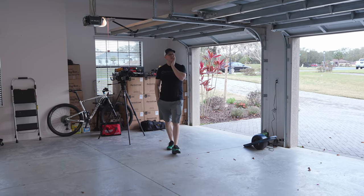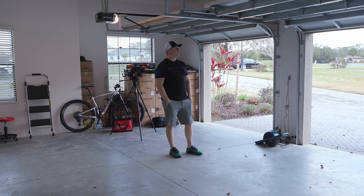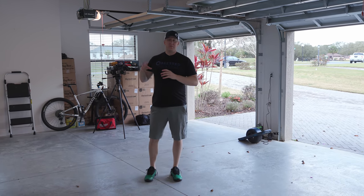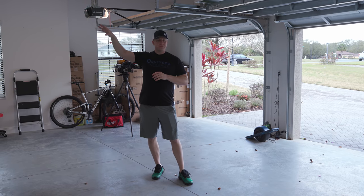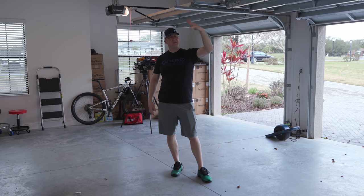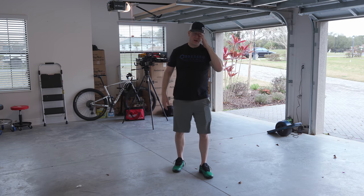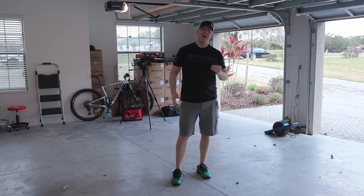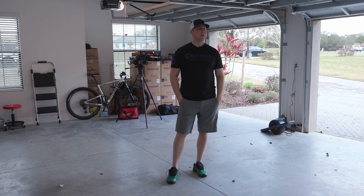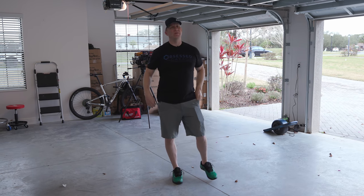I'm going to work on finding some solutions that seal up the door so we can air condition and dehumidify this space. We're going to start with a Mitsubishi 18,000 BTU unit and start with relocating the three and a half ton. We're going to vent and condition the attic as well. The hope is that I won't need to add a dehumidifier, but we may add dehumidification to the house because the house is a sealed envelope, unlike most houses that have vented soffits in the attic.